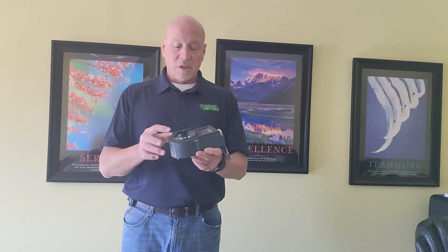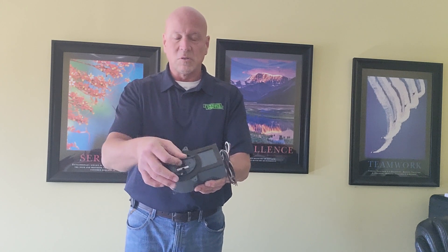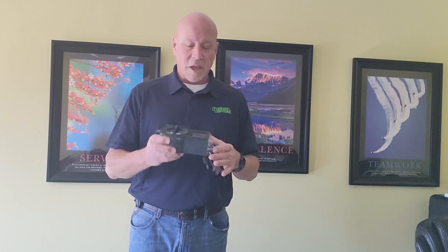This is one that I've had in my home too. It has a little self-cleaner on it. These two posts right here work together and send ions out to gather the dust and kill the product. This little bar here also cleans it — kind of goes around and cleans these so they don't get clumped up. This gets installed down by your blower motor, so the air is going by it and these ions are attaching to any of those items going up into the home. One thing people notice is it tends to look like you have more dust in your home. It's not that you have more dust — it's that these ions are clumping the dust together so it's looking bigger. What it does is that it falls out of the air, you can clean it up off of surfaces, and your air filter works better. So initially it looks like you have a lot of dust all over, but over time that should clear up and you should start noticing less dust.